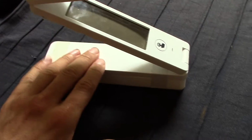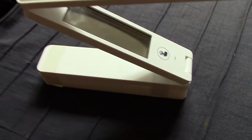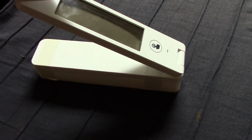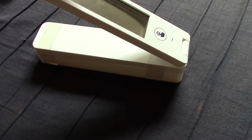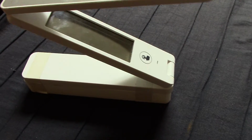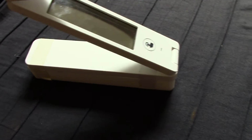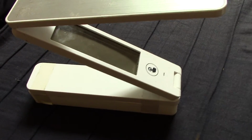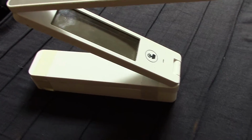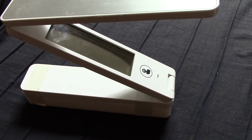One other thing I should note is that I did need to add an extra N-channel FET inside here on the main board, because that uses a FET, or actually it's a transistor in the original design, to switch on the LEDs. There's a logic level signal that goes to the FET, and when it's high, when it's 5 volts or 3.7, whatever your battery is, then it'll switch the ground signal. The ground signal will connect to the negative side of the LEDs here, like an N-channel FET normally works as a switch, and turns it on. When I first was using the step-up converter, though, with 5 volts, it started to smoke and burn. And that's because it couldn't handle the higher voltage and current that I was putting through it. So I had to add a beefier N-channel FET there.